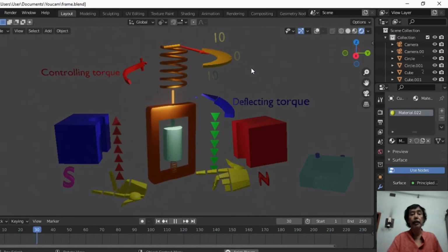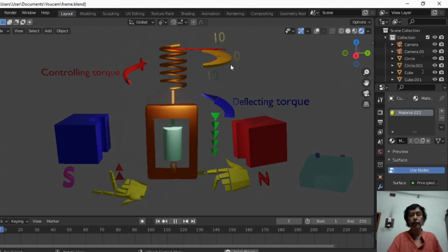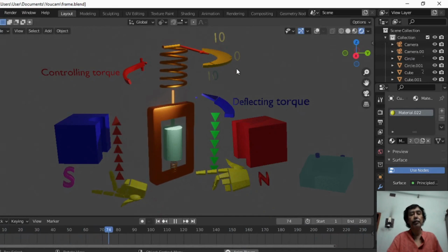Similarly, if we connect a high resistance in series with this galvanometer, it will be converted into a voltmeter. In a similar fashion, if a known voltage of 10 volts say is connected across this circuit and the deflection is mark 10, then it is 10 volt. Then it can be calibrated in this way, and an unknown voltage of 3 volts say can be measured when the deflection is at mark 3. So this is the basic principle why the needle of a galvanometer deflects.